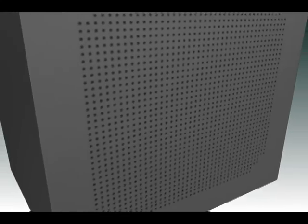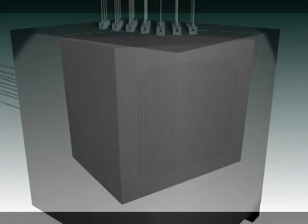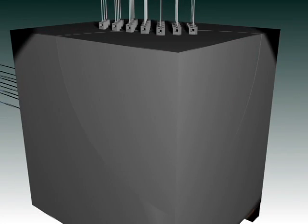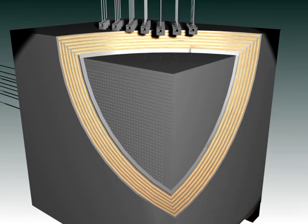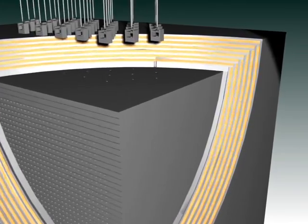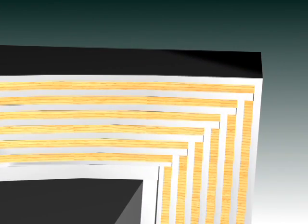This inner core is surrounded by a wall of cast iron blocks as a safety or thermal shield. These blocks absorb 97% of the gamma radiation emitted from the core. In addition, there is a biological shield outside of the core to protect workers in the area. There's 52 inches of laminated steel and masonite, and on the outside of that, a one inch thick boiler plate that encloses the whole thing and makes it gas tight.